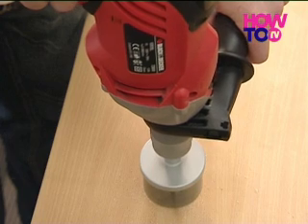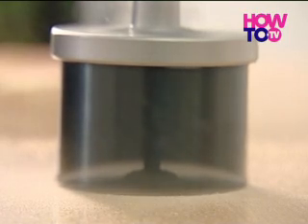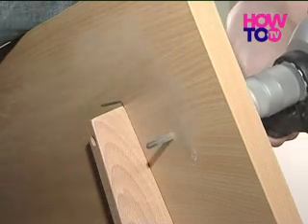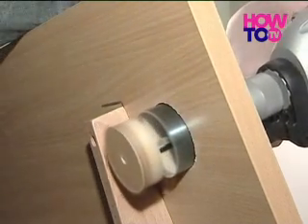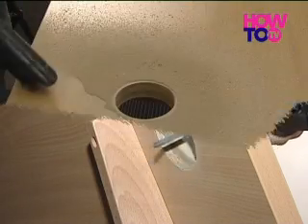By this stage, the standard drill bit may be through the underside of the desk. Once you ensure that the drill bit is straight, with the serrated teeth just above the surface, start the drill and hold firmly as the drill cuts with a circular motion. The centrepiece should drop cleanly through the new hole once finished.